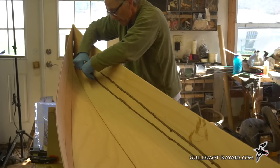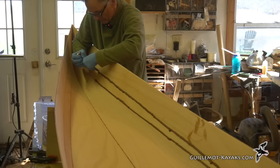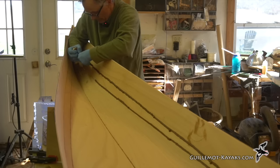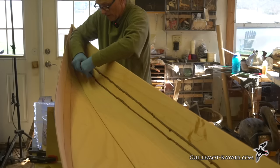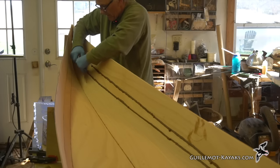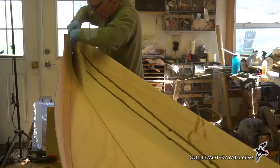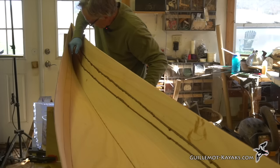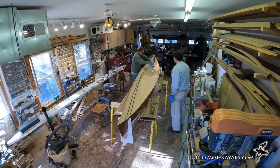You can feel the heat coming off the epoxy now. If it actually feels hot, stop using it — once hot material is distributed it cools quickly, stiffens, and you lose the ability to shape the fillet. Priority: get remaining material out onto whichever seam is easiest, then come back to any spots you need to.